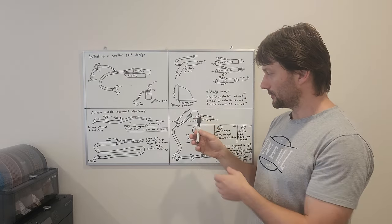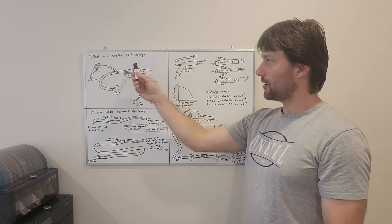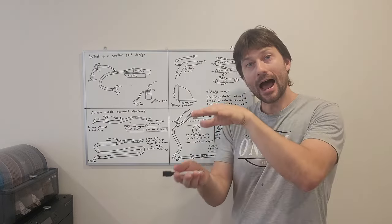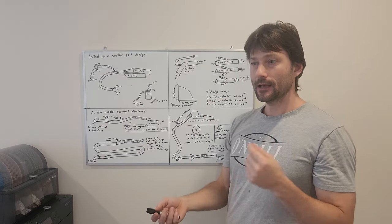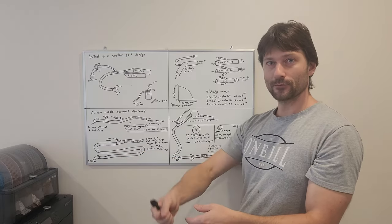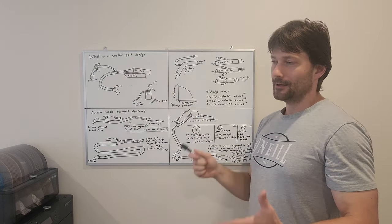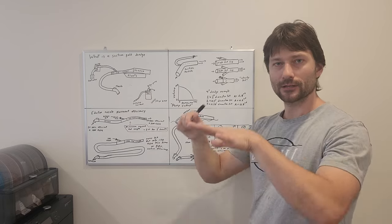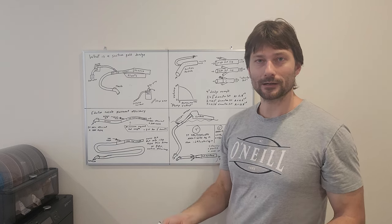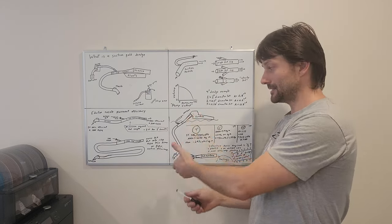Having a crash box on top, as opposed to a direct setup, means if you get air sucked into your nozzle the jet log will spray foamy, airy water and blast over your sluice box — you're concerned about losing gold. With a crash box you have to lift the water slightly higher above the surface, decreasing suction efficiency. But in my opinion, your fine gold retention might actually be better since you avoid accidentally blasting the sluice. You have a little damper after either one — it's a trade-off between efficiency and gold retention.